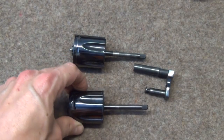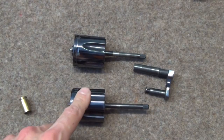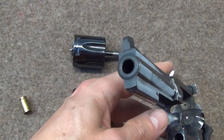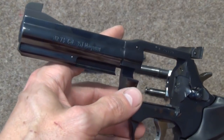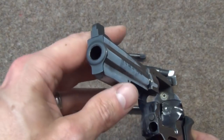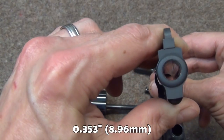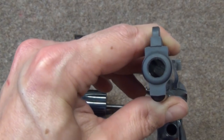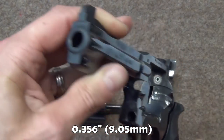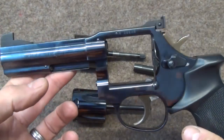These 9mm cylinders can be found independently of the revolvers. However, there was a change in barrel dimensions: up to and including serial number 39200, the bore diameter is 0.353, which is perfect for using 9mm. But above that serial number it went to 0.356, so the performance with 9mm will probably not be as good as with the older generation such as this one.